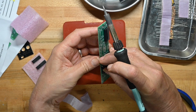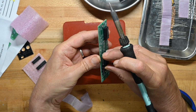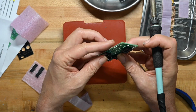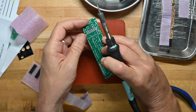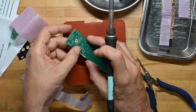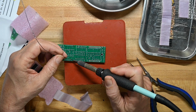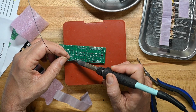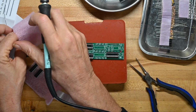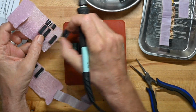There's one bent pin there. I can fix it like that. There we go. Again, double checking pin count and saying, why are you falling off my finger, you silly thing? So, if you're going to do that, I'm just going to set you down. I don't know why I wasn't setting it down before. Oh, I know why, because I only had one socket. And it wouldn't balance on just one socket. Let me take these all out so I don't have to keep going back.